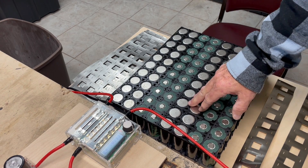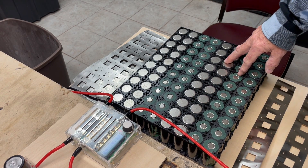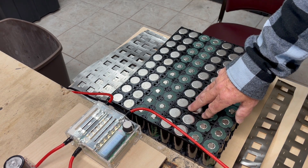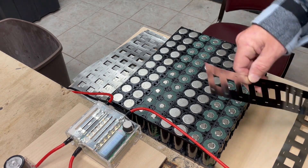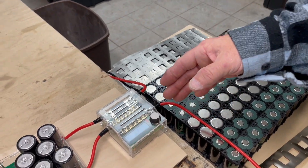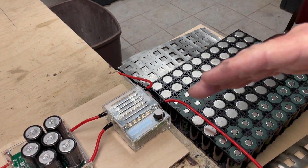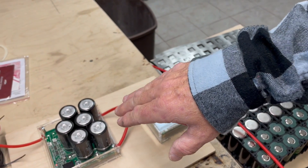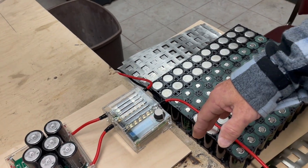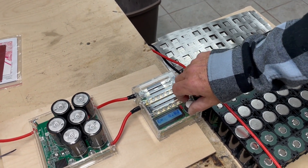Like I said, the cases are very expensive. With four of these batteries, I'll have a total of four 100 amp batteries, and four of those won't fit in the case I'm using for the generator. I'm going to be using nickel strip and a spot welder. The spot welder is a KWeld, hooked up to my benchtop charger set at nine and a half volts. It's got KCaps — basically big capacitors — and I'll be setting the KWeld to about 70 joules.